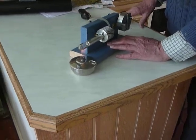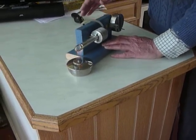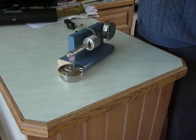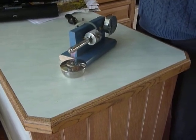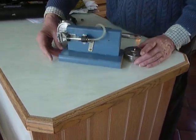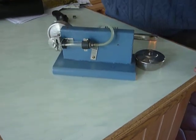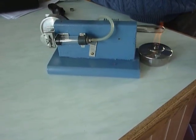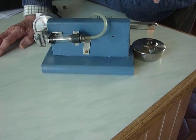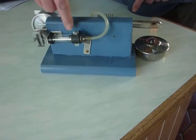It's going to get there. This is an engine like nearly all of them that has a fixed length stroke for the piston. Why do we do that? I think it's because steam engines, petrol, and diesel engines have a fixed amount of fuel or steam going in — a fixed amount of energy — and therefore a fixed amount that we can push the piston. So the stroke length is fixed in a steam, petrol, or diesel engine. But Stirling engines aren't like that. The faster this runs, the less time there is for heat to get in, and therefore less ability to push the piston.